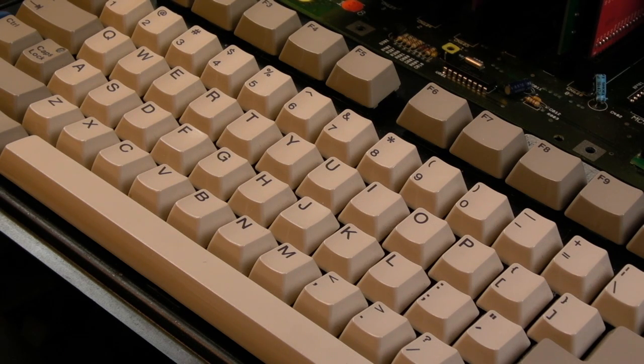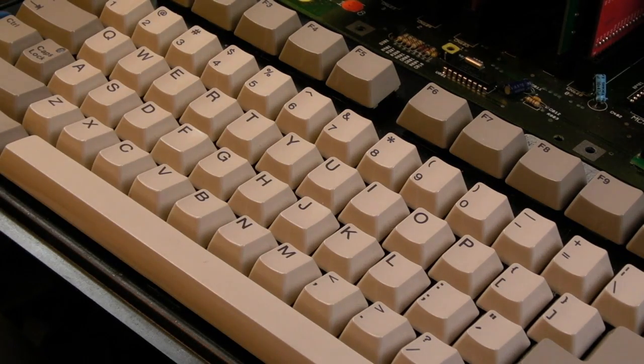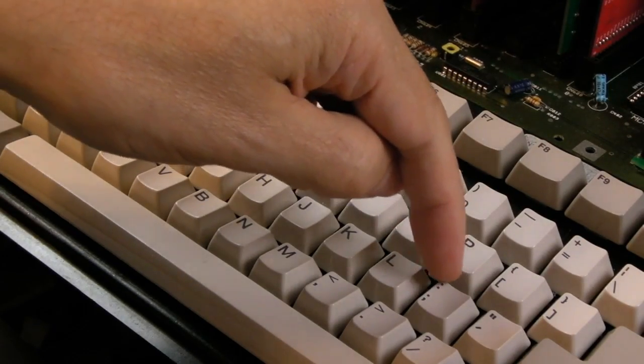There are some unusual types of plastics, but I haven't come across any on my channel up until those keycaps. So you could soak these keycaps here in IPA, will they crack? No, they won't. Same with any other Amiga or C64 key. Now, I think the only exception on the C64 keys is where you got the print on the front.